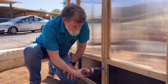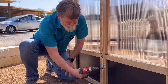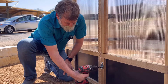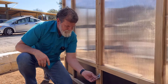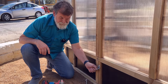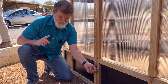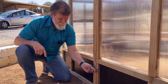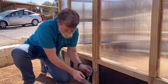We're going to tighten these bolts against those T-nuts on the back side. You don't need to go crazy tightening them — Kevin's on the other side holding them. These D-rings we have custom built. Those bolts are grade-five bolts, and each one is good for at least 1,200 pounds of pull — which is probably greater than the turnbuckle or the nail holding it into the ground — but these D-rings are definitely strong.